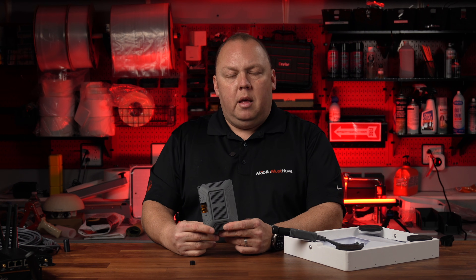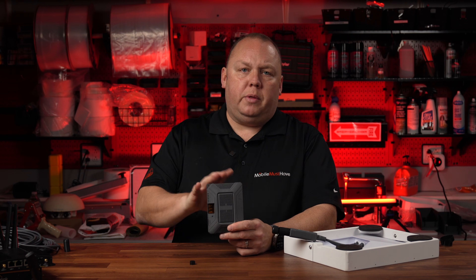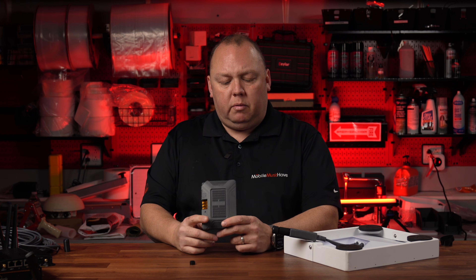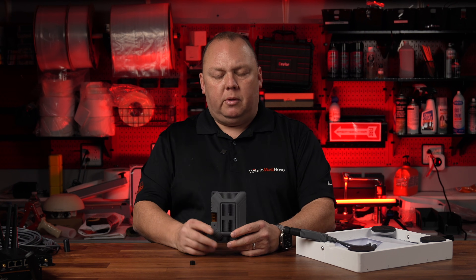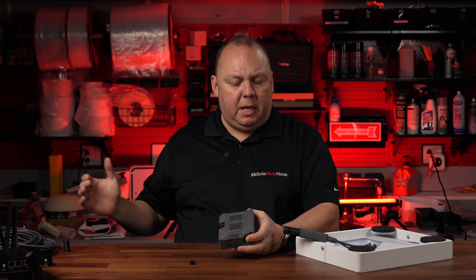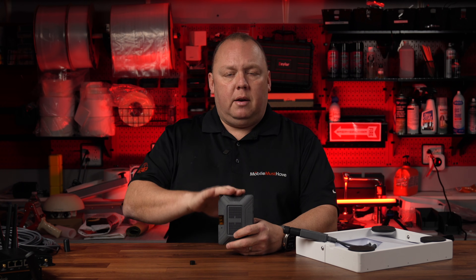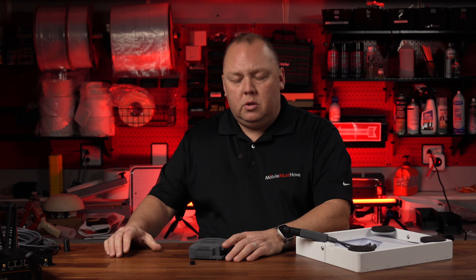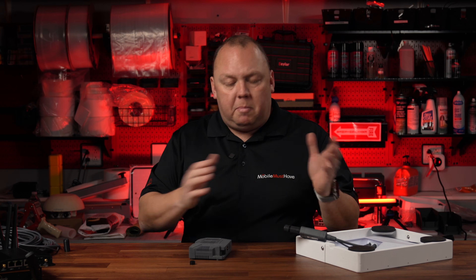Now this is our 200 watt passive PoE injector designed specifically for Starlink. This comes with the Starlink Mini kit, but note that this is powerful enough to also power a regular Starlink V3 dish. We sell this at a lower cost for folks that want to use it with the V3 dish, but if you want to swap or use this adapter and a single Ethernet cable up to the roof by wiring this DC converter — this passive PoE injector — you can use it with either dish. You can't use it with the HP, the high performance big dish that needs 300 watts, but you can get almost all the other dishes to work with this kit. If you have an HP dish, we have a different kit for that. This is specific for the Gen 3 or V4 dish and the mini.